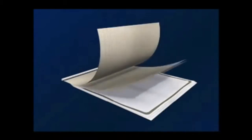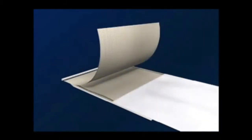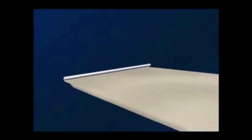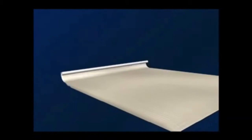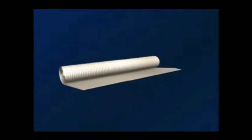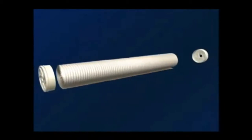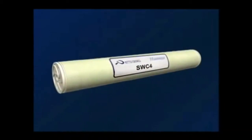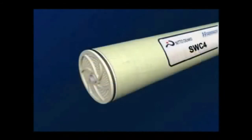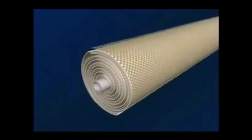The leaves are glued along each of the three exposed sides and then rolled around the core tube. With the back of the membrane completely sealed to the edges of the permeate spacer.